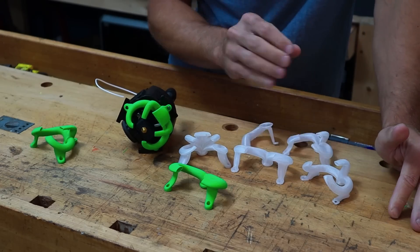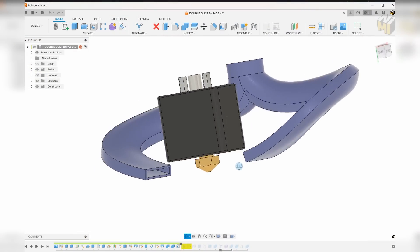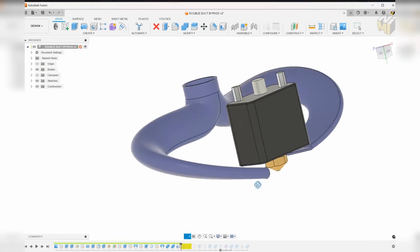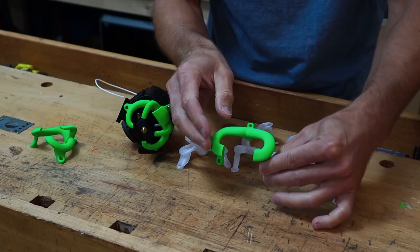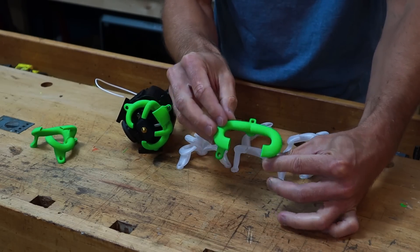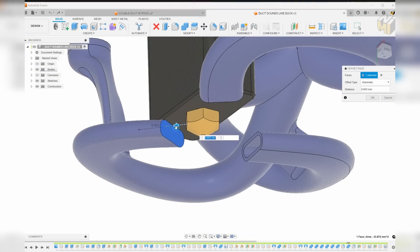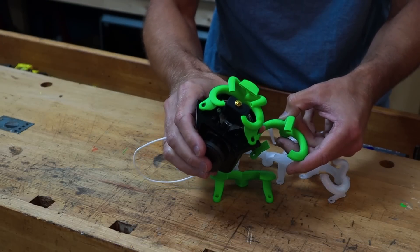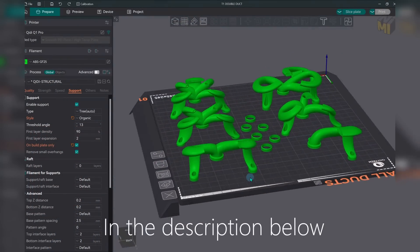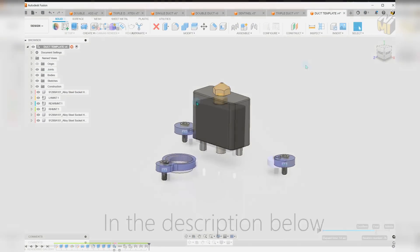All of this testing has raised more questions: Is the oval port the right shape? Should it be more rectangular, or maybe a teardrop shape? How wide should these be? Is the large swooping shape really necessary? Exactly where in Z should it be pointed — should it be more horizontal than I had it? And should the ducts be brought even closer to the nozzle for better cooling right at the tip where the material is extruded? None of these are perfection, so I've linked them for you to download and test yourself. I've also created a template file if you want to create your own, and I'd like to send out a challenge to anyone who thinks they can do better — send me your design and I'll print it and run the test.